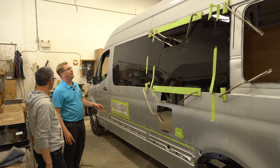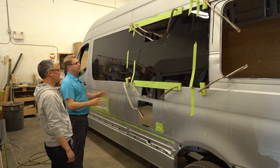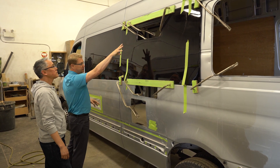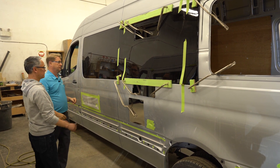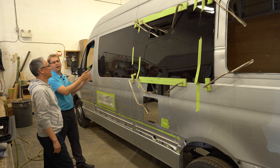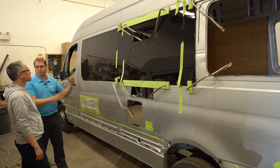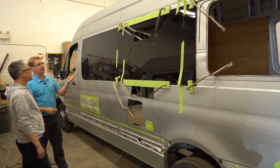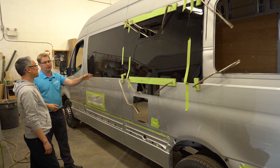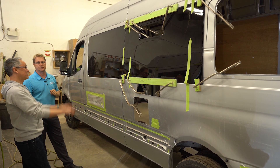What's happening over here? Because this looks like a mechanical spider coming through the holes. What we're doing here is — to maintain that automotive look yet we have to install the fridge — we needed to create a fiberglass panel so that we can have our upper fridge vent and vent it properly. Yet if you look at the two, it looks like glass. It maintains that sleek look without giving it away. The original piece is a rough template, a mold for us to make the fiberglass piece from. Then it all comes down to the skill of our painters painting it with that high gloss. And high gloss black is a delicate color — it shows scratches — so we have to be very careful. But the finished product is a mirror image of the glass. It looks like a hole's been cut in the glass.